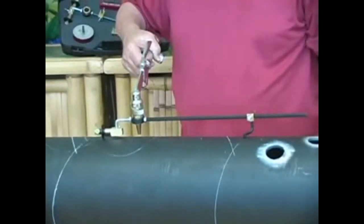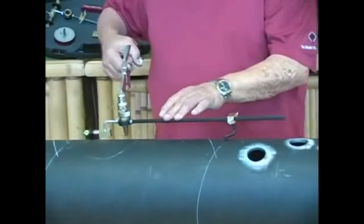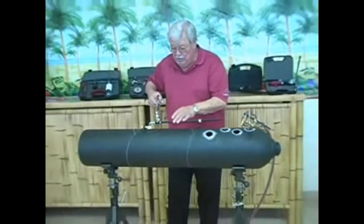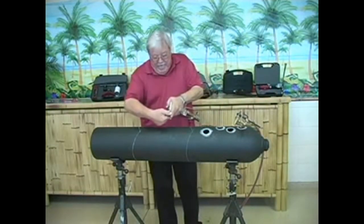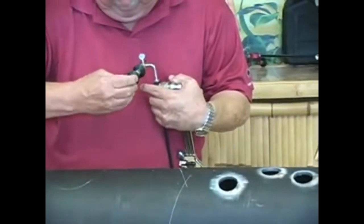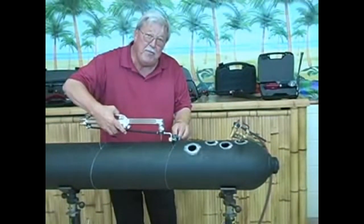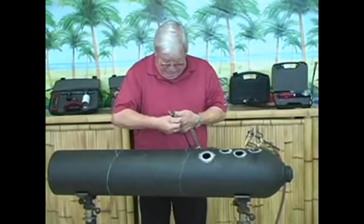This will go up to 42 inches and down to 5/8 of an inch for a small hole. You don't need the wheels when you get into any holes up to 4 to 6 inch. But when you get larger than that, you do need to have wheels on there. You actually can stack the axles on this little tool, make a little dually out of it, and trim off the edges of plates. You can actually chamfer plates. And it's probably one of the best-selling tools that we have, the little chariot guy.